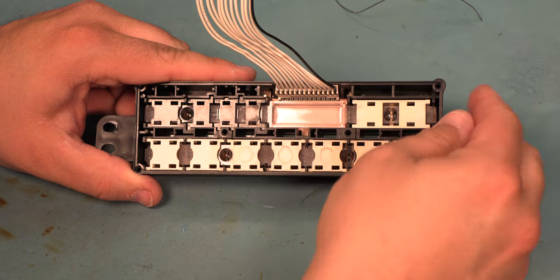To install the new bulb, we're going to bend the wires apart slightly. We're going to make sure one wire goes down each of the 2 holes in the socket so that the leads aren't shorted together. We'll see some grooves in the plastic. We're just going to bend the leads off to the sides. We need to wind the lead around the side of the plastic base 1 entire turn counterclockwise, making sure that we use the plastic grooves in the base.